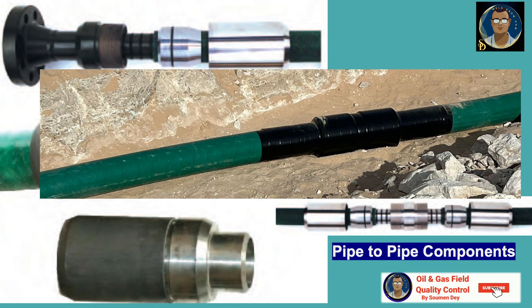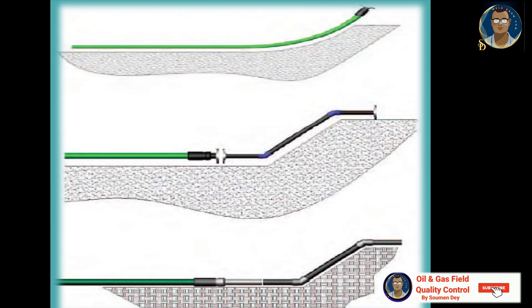At the end of the pipeline there are metallic risers bringing the pipeline above ground. All RTP pipelines discussed here are underground, so to bring them above ground and connect to the facility piping system, metallic risers are used. The metallic risers are connected using three common methods for terminating the RTP line pipe. The first method is surface tie-in.